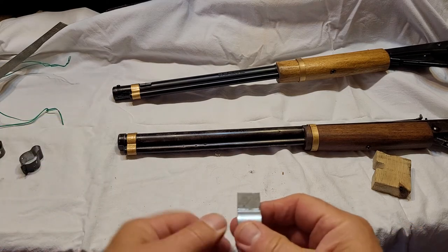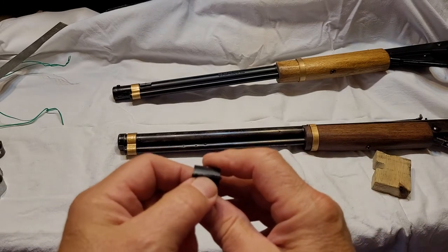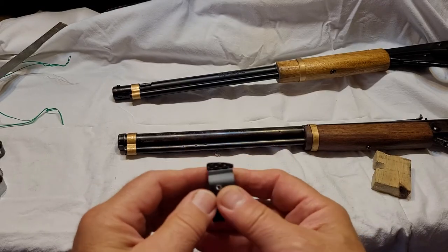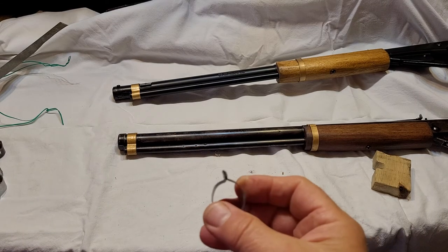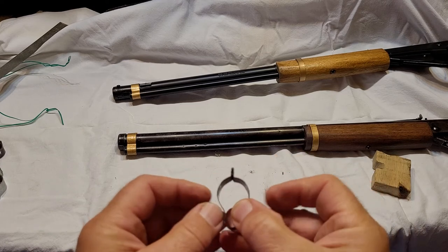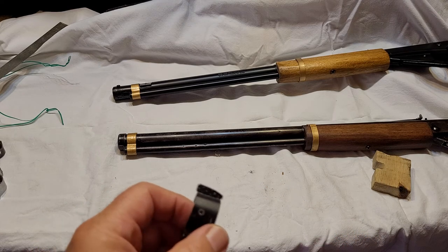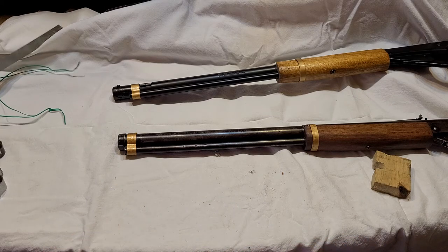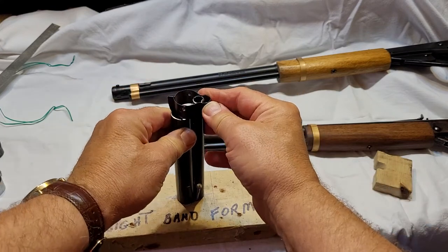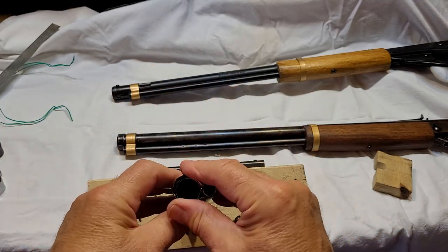So what I end up with — this one here has been silver soldered together. You can cut the height down to whatever you need. This finished one I actually did double duty on: I silver soldered it plus put a crimp band on it, and then I was able to cut it down, grind it, file it, and make it in the shape of a front ramp sight. The reason there are two holes here is because I did have this applied to a gun, and wanting to keep things in place I used two tiny screws to hold the sides in. You can use adhesives, spot weld, or whatever you want to hold it on the front of the gun. This sight fits down in here — you can see down inside where it's going to fit over top.